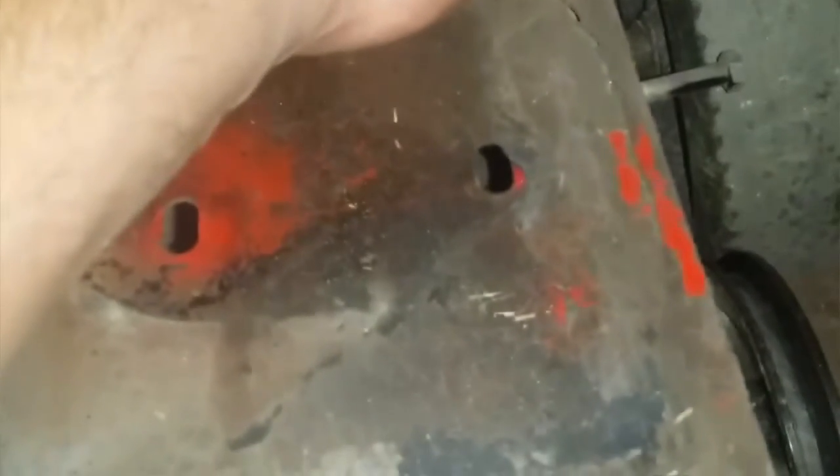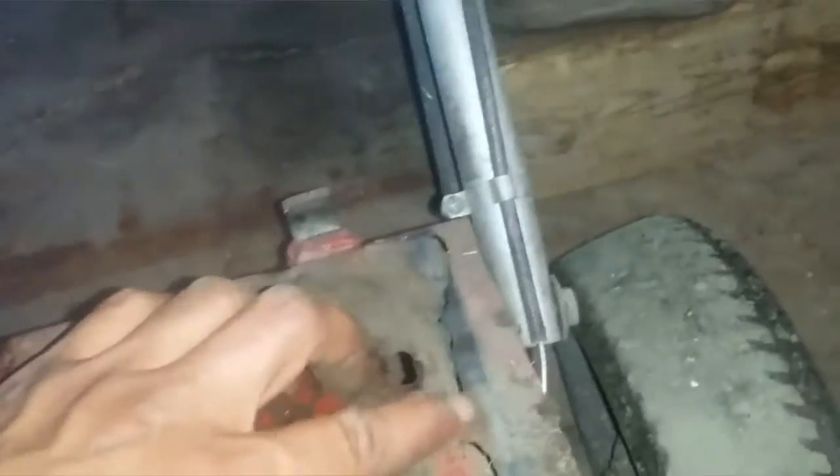Problem is, I'd really like to run the bead on the underside, because this part really should be very, very smooth, but that's a lot of extra steps, because then you have to take the entire blade out. It's probably the right way to do it, but I'm going to be lazy. I'm just going to run the bead over here and clean it up with a grinder where the mounting plate actually needs to touch and lay flat, if that makes sense. This part we'll have to clean up inside, but out here should be okay. The stuff out here won't be as big of a deal.